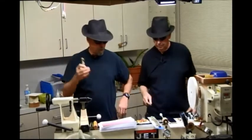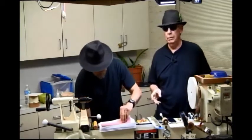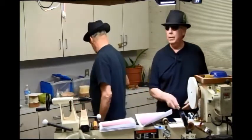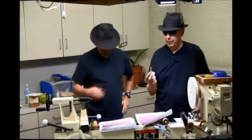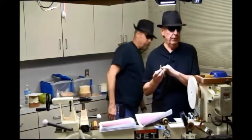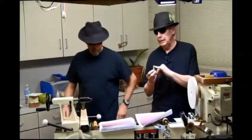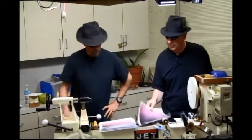They're just the brass parts. We're using quarter-inch fittings on everything. The only place we're not using the quarter-inch is when we build the vacuum adapter. It has a half-inch barb, and we do that so that it fits inside the bearings. The bearing has a half-inch hole in it.